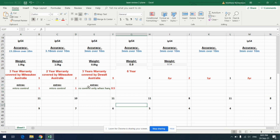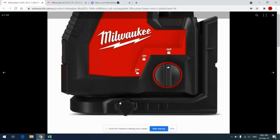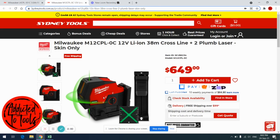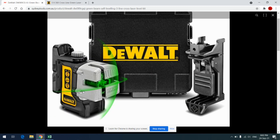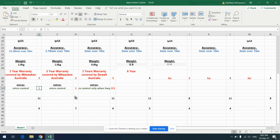Down the bottom I've done extras — micro controls. If you don't know what a micro control is, it's a dial on the laser that allows you to make tiny adjustments while it's sitting on the bracket. If you've used lasers before and had someone doing left-right adjustments, it's an absolute pain — this dial lets you make micro changes, which is fantastic and will definitely help sell a laser to me. The DeWalt has one on top, but unfortunately it only works when the bracket is attached to something else, not while sitting on the ground, so I gave it half a mark.